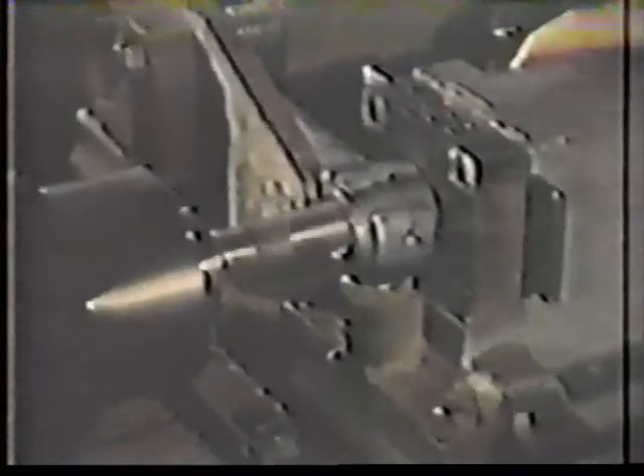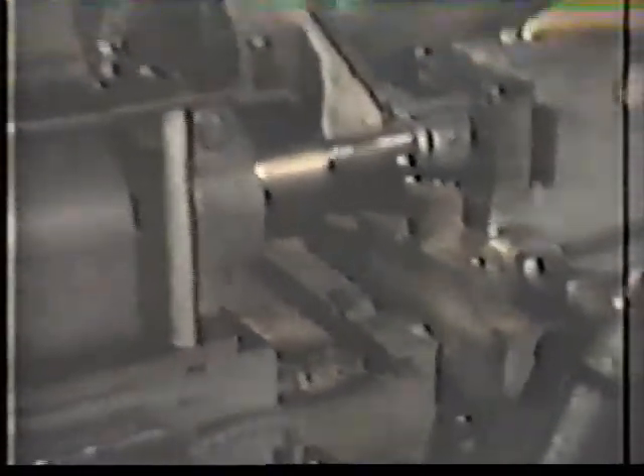When the crank pin end is balanced and when the wrist pin end is balanced, the weight of the connecting rod is held to the small tolerance of plus or minus one hundred twenty-five thousandths of an ounce. Wrist pin and crank pin holes are held to a tolerance of two and a half ten-thousandths, and precision ground for absolute smoothness. That's to ensure full contact on the backs of the bearings, which makes for good heat dissipation and long bearing life. The bushings are diamond bored on another machine specially constructed in our plant to hold them to a tolerance of plus or minus one ten-thousandth.